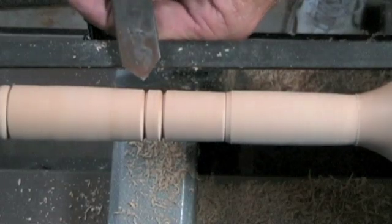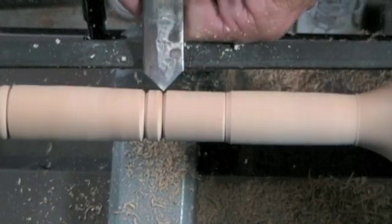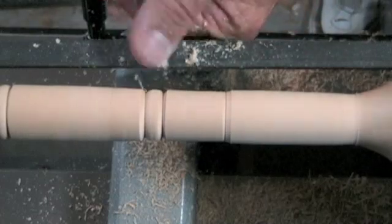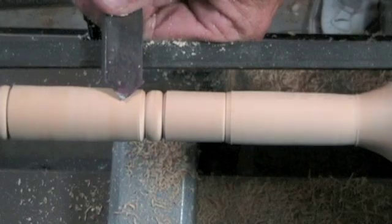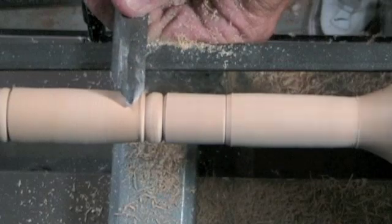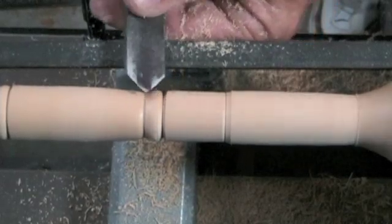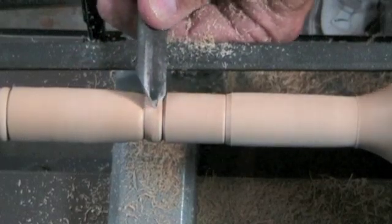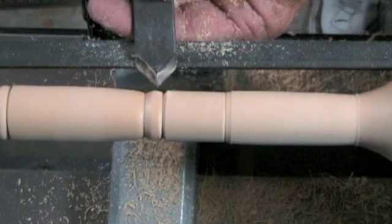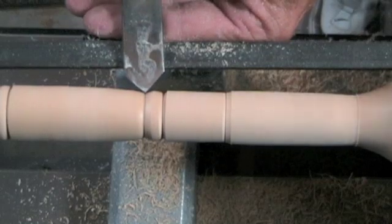A tool that came with a lot of the early sets was a V-tool. The V-tool was used by pushing it straight in, and then you could turn a bead by simply pulling it across and shaping the bead. I had a friend who was a professional turner and he started using it somewhat like you would use a skew — using the planing edge to roll the bead, using the bottom edge. This one is a little bit grabby and takes a fair amount of skill to use. It's ground flat on both angles because generally it was used as a scraper when sold with the kit. My friend developed different cuts with this tool because whenever he had one tool in his hand, he would use it until he couldn't stop — that kind of sped up production on the work.